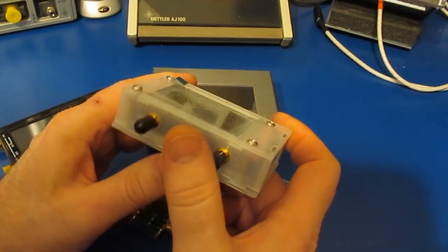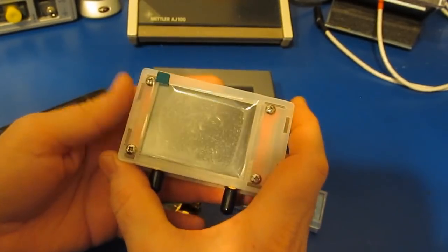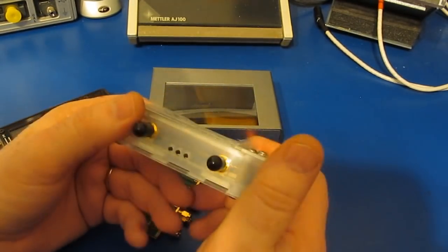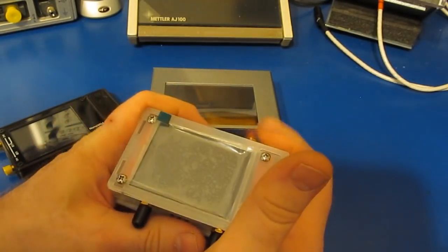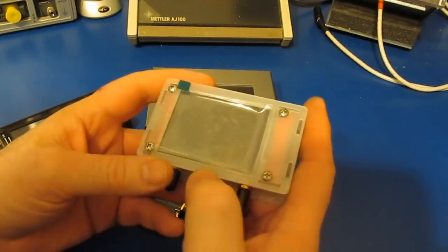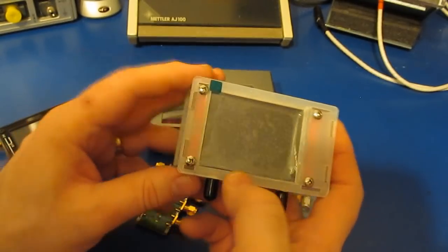Of course, I was running these things for hours at a time, and what I found is that this unit would hang. And when I say hang, essentially what would happen is it would stop communicating on the USB bus altogether. It's kind of odd because the PC didn't actually see the port close down or anything, so as far as Windows is concerned, the unit is still alive and active, but the unit fails to respond to any commands. The only way that I found that I could shake this thing loose is to power cycle the unit.